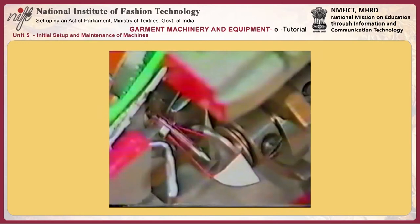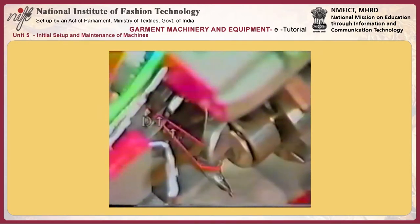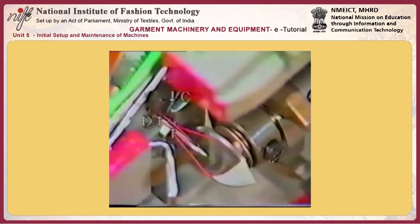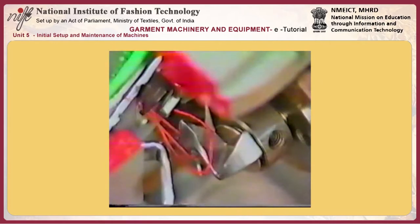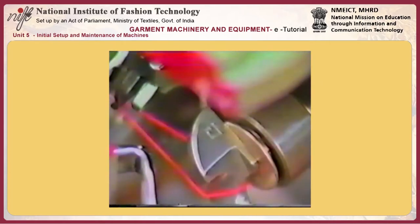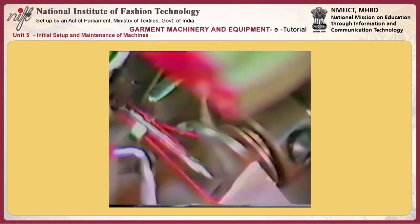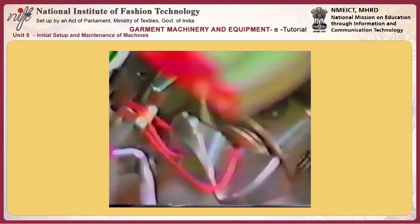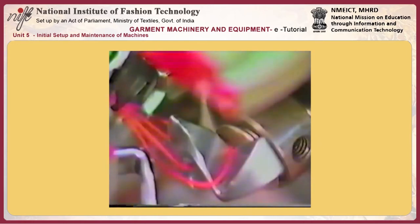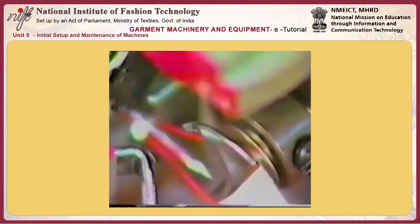Number 9, principle of sewing. The needle comes down and looper A tucks needle thread B. To secure the thread triangle, yoke slide C securely holds D. The looper point passes through the thread triangle tucked by the looper. The yoke slides go back immediately after the looper passes through the thread triangle. These steps are repeated to form stitches.